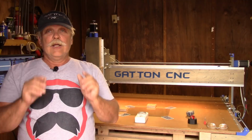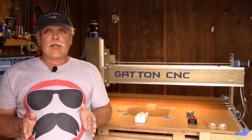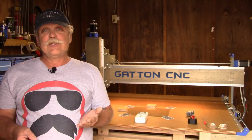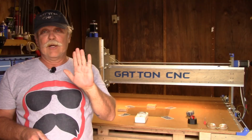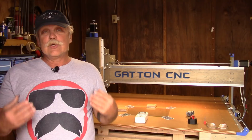Now, the tramming plates that I made in episode 10 of my Gatton CNC router build, and there's a link to that episode in the description box below, are going to help when it comes to adjusting the tilt, but they're not going to do a thing for me as far as adjusting the nod. For that, we're going to have to do it the old-fashioned way, which is loosen up the mount and tuck shims between the router mount plate and the front of the Z-box, either on the bottom or on the top, depending upon whether we need to bring that router back or move it forward slightly. But for the tilt, those tramming plates are going to come in handy. So let me go ahead and show you the tools that we're going to use for this, and then we'll get started.